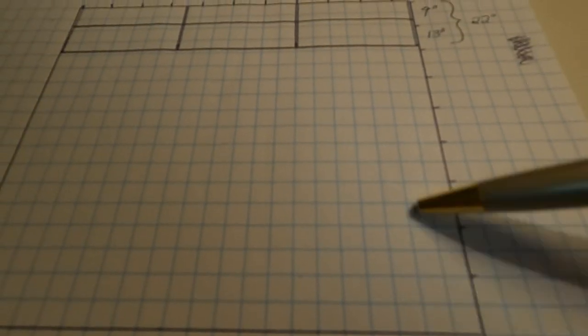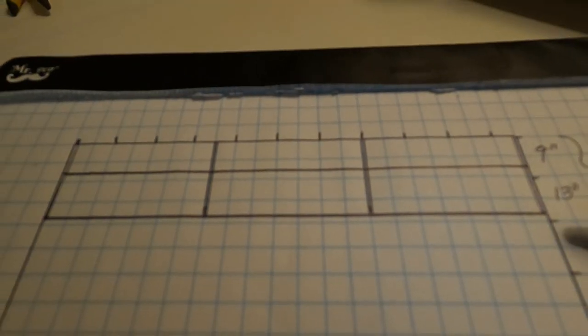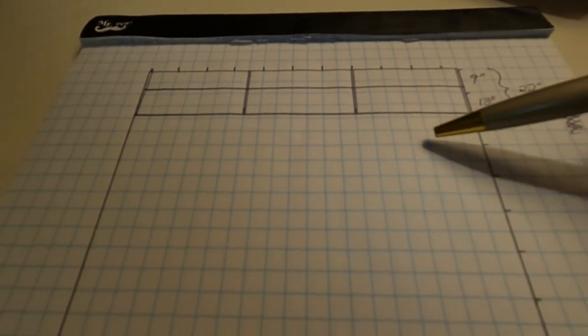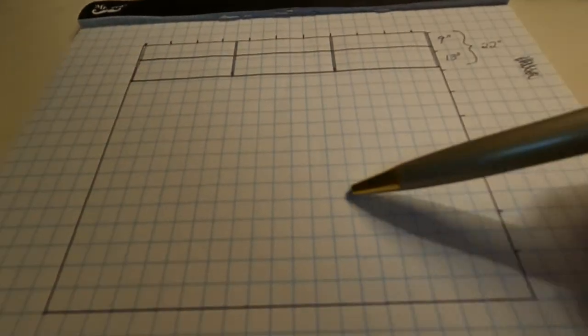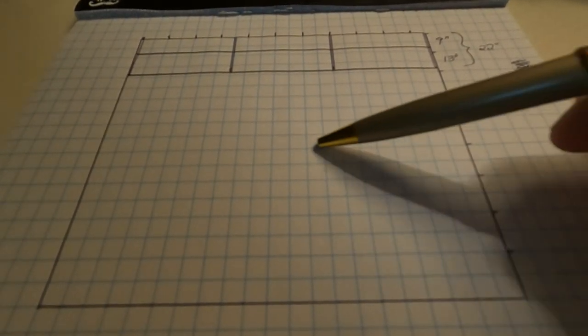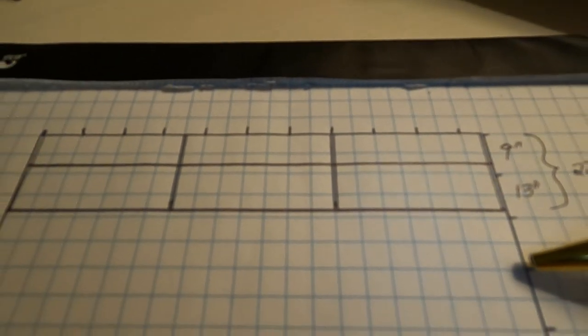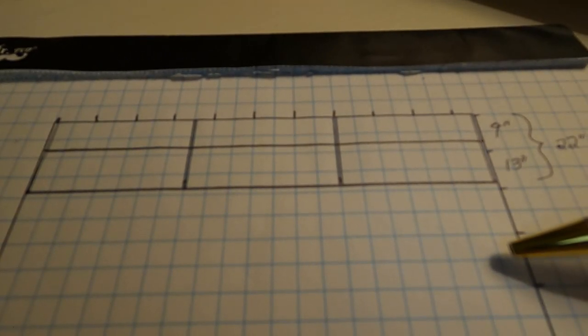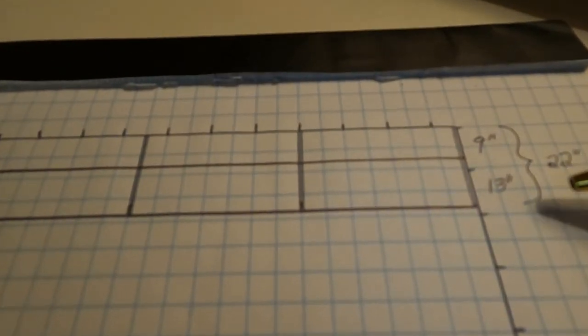On this graph paper, each square represents 6 inches, so 2 squares to a foot. This is the 9-foot high wall, and then 10.5 feet wide. I like this because I want to be able to hang paintings and prints below this wall unit, and then put a desk underneath, or if I ever decide to use this room as a bedroom, I would have room for a headboard then. I also like these measurements because I bought those 2 4-foot long boards to use for the vertical pieces, so I'll have enough wood then.